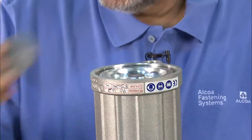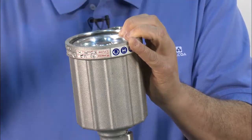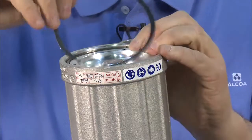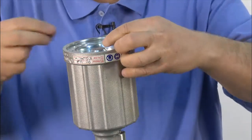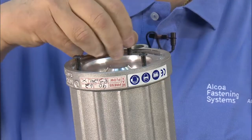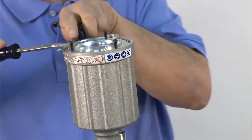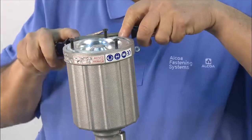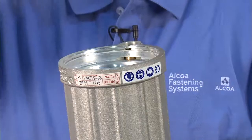Remove the muffler. Tap the bottom cap down with a brass or plastic mallet. Use a screwdriver to pry up and remove the SpiroLox ring. Use the three Allen screws removed earlier to help remove the back cap. Gently pry up the back cap using two screwdrivers.